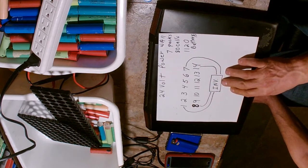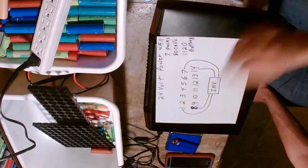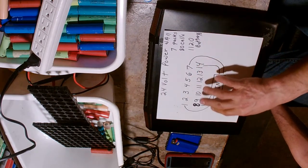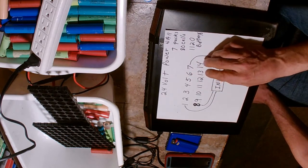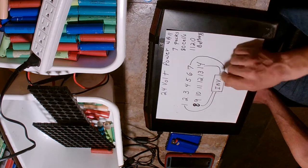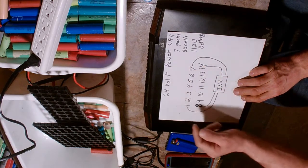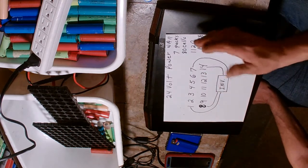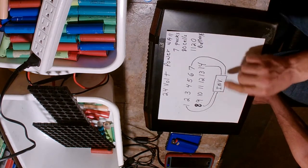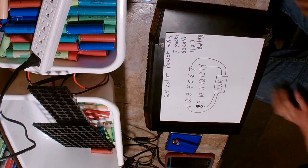My recommendation: if you're going to build a DIY powerwall, go with a 24 volt system and build your packs square. You'll get less heat and better balance. In my system I'm not installing balancers or a battery management system. Seven packs per string - five kilowatts is the seven-string ballpark, depending on your cells - but a 24 volt system is the better choice for these reasons.